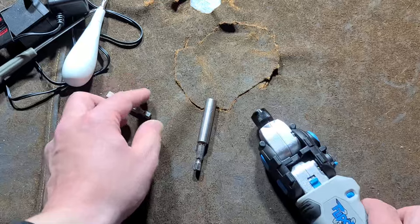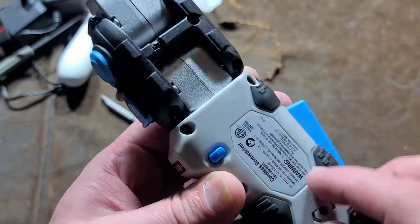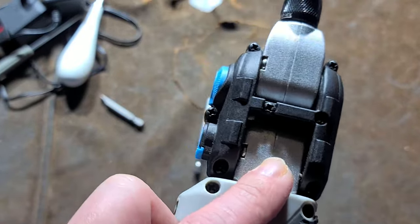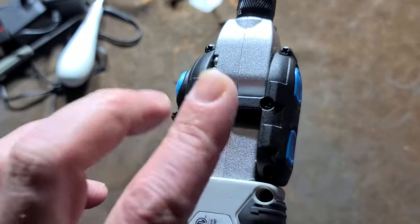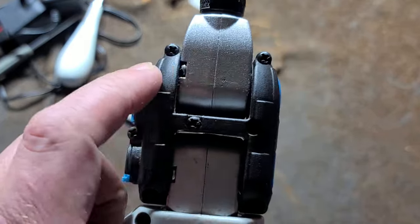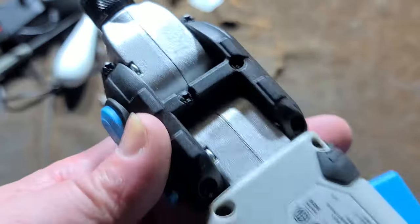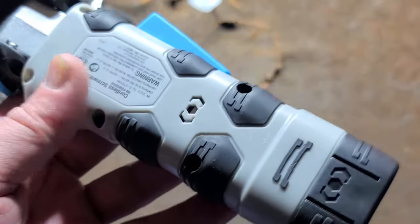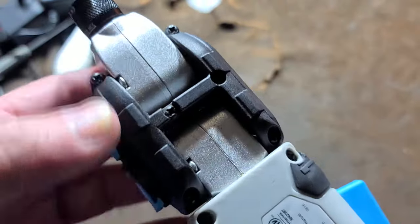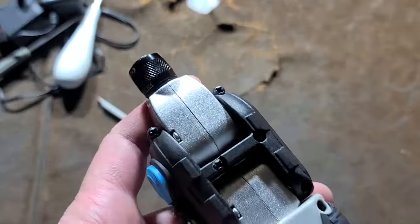There are lots of 8-volt max screwdrivers which are going to be much more powerful than this. The way it's geared, you're going to have an electric motor, planetary — probably a two-stage planetary reduction gearbox — and a whole set of spur gears in here. There's going to be a bevel gear going out to a set of spur gears, going back into the front head. The complexity of this driver is obvious — it's not only a traditional electric screwdriver, but you have all these extra components, the whole articulating midsection, and all the pieces for the locking. There are just a lot of parts in this.